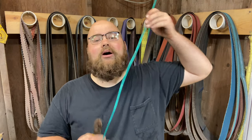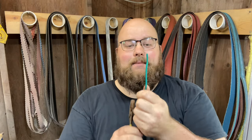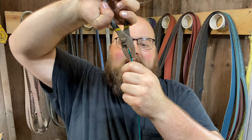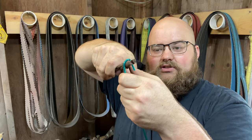Before we heat up the steel, let me show you on this piece of wire what it is I'm going for. The first end I'm just going to taper out to give me a nice little spike to put down into the ground. On this side I'm actually going to be hanging the basket, so the first thing I'm going to do is go down a couple of inches and bend it over 90 degrees.